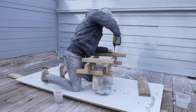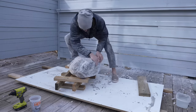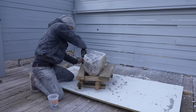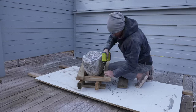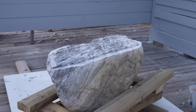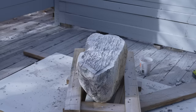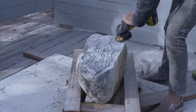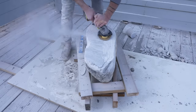For me so far, the most difficult part about working with stone is just the weight and stability. A lot of the time is just spent figuring out how to move things around and get them nice and stable so that I'm setting myself up for successfully transforming organically shaped surfaces into things that are more ready to interface with an architectural environment. I'm using a small level to keep checking that I'm not going too far or not far enough. I switched from a segmented cutting blade to a grinding wheel I really like, and now I'm just going to smooth out all those rough cut and chipped edges. This may seem really tedious, but I actually thought it was pretty fun, and it only took about five hours.